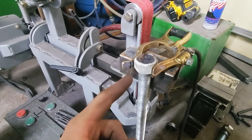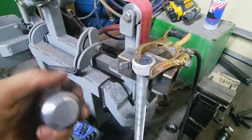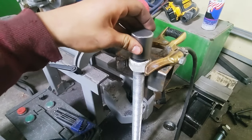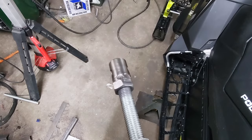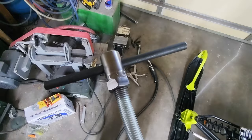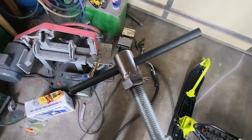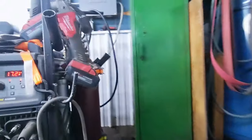I just welded the nut on the end of the threaded rod — I threaded the rod halfway into the nut and then filled the rest with weld. Now I can flatten it and bevel the sides of the nut slightly before welding around the perimeter. It's a little crooked of course, but it's on there. I think I'm going to weld both ends of the handle to keep it on. We have like maximum porosity going on here — I think I am finally out of gas.